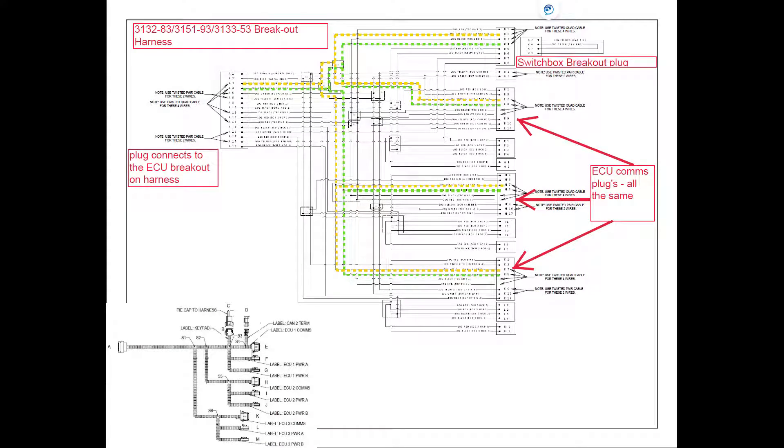From the ECU breakout on the rear harness we will be attaching an ECU breakout harness. That breakout harness on the tank is going to be a triple harness — the part numbers are listed here and they sub up. We're going to be going in with CAN high on pin 3, so at A3, and we're going to go through and it's going to splice off. The first place we go is to the switch box breakout for this harness — this is where we plug in the tank switch box — and our CAN high signal is going in on pin B.